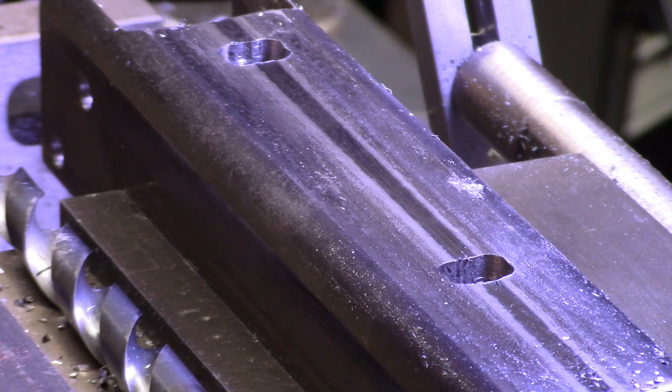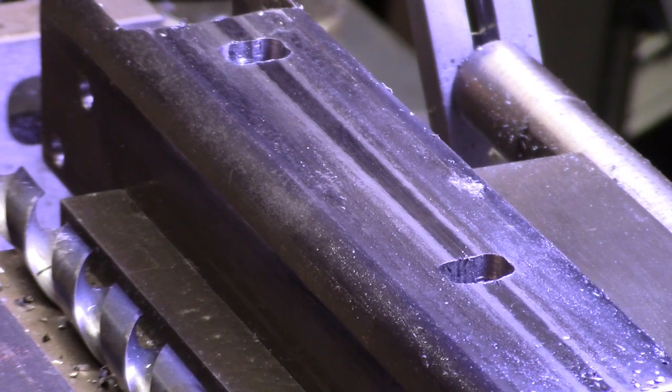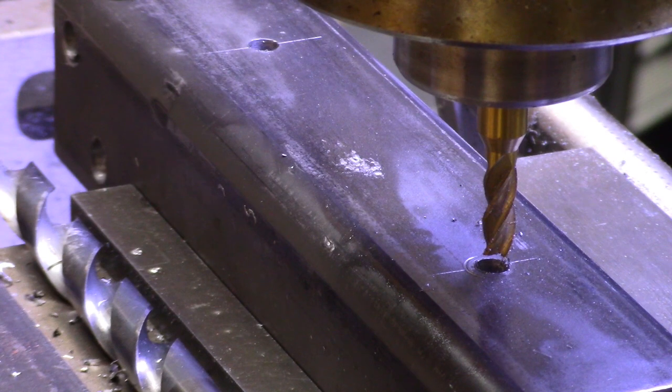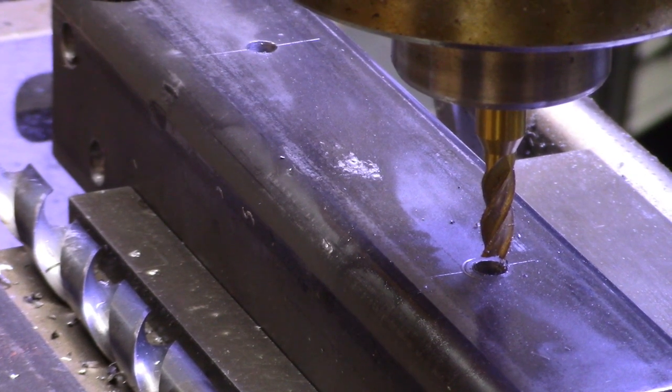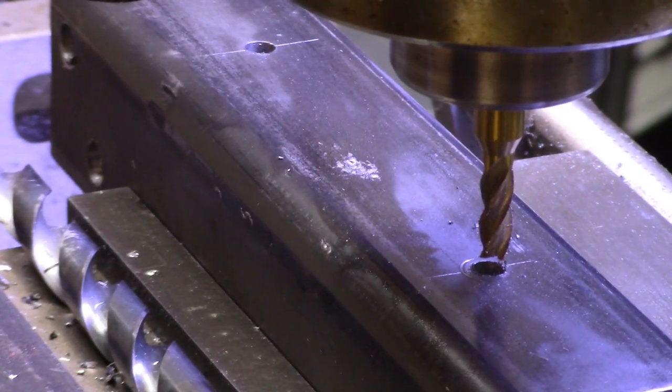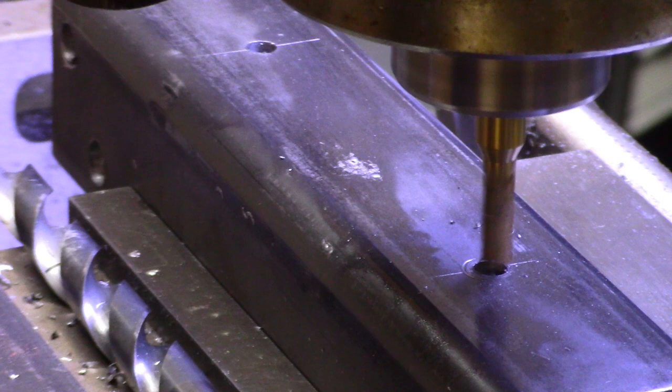Inch through there to tighten and loosen and adjust the screws that are going to be slotted on the other side. So now we'll roll it over and get a look at the other side. I don't know if I said so or not, but my intention is to put a 1/4 inch slot. It's about 100 thousandths wide. That should give me plenty of adjustment for things. And if it doesn't, I'll bring it back over here and do it again. That's the only way I know to do it.